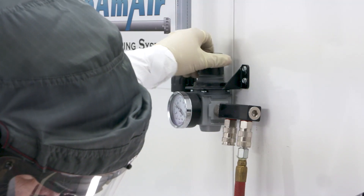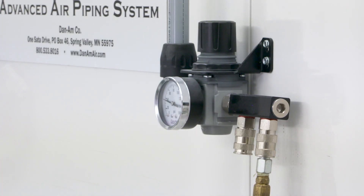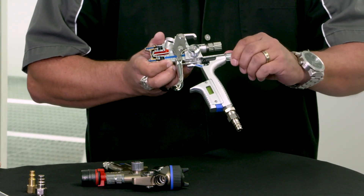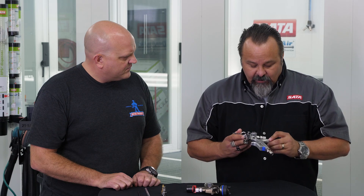The important thing to remember with a spray gun is if I only need 26 PSI at this spray gun — this is an RP version, it only uses 10 CFM, with a range of pressures from 18 to 29 — there's no need to have 110 or 120 PSI. By regulating at the wall down to close to what I need, if I need 26 PSI I may regulate at the wall so that when I pull the trigger I only have maybe 30 PSI, then I make my final adjustments with the air micrometer knob. Check pressure at half trigger and also fully pulled before you start your paint job.